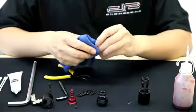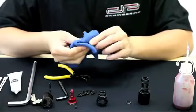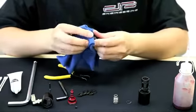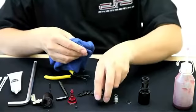Clean and check the O-ring on the velocity adjustment screw. If this screw is damaged, replace it with a 9.25 x 1.78 O-ring. Next, clean the top portion of the regulator system as well.